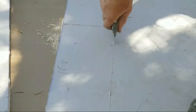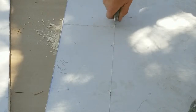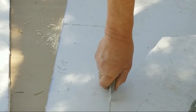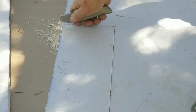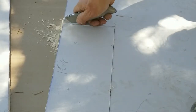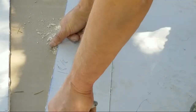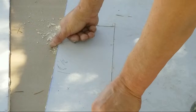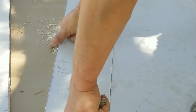Okay, now I've got drywall below this I'm having to be careful with. There's a corner. Now I'm going to cut through that drywall a little more. Now I'm going to cut down through here. And the other side. Okay, I gotta perforate it. Bam. This will give you a line to follow on the back side. That is the purpose of giving it this perforation.